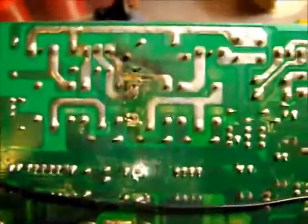As for ICs on the board, I recognize this IC which is an LM324N — a quad op amp. It's been placed in a socket, I guess just in case it blows so you can pop it out and put a new one in. There's no real reason why that IC would be gone. I think the ICs should be okay. From what I can see, the trouble has happened between basically where it switches over between the UPS and the mains. I'll keep you guys posted on whether I'll repair it or not.